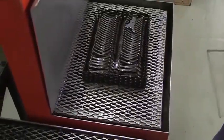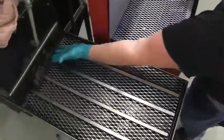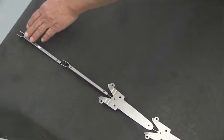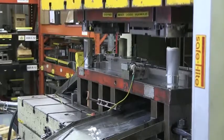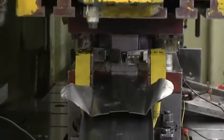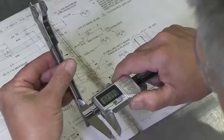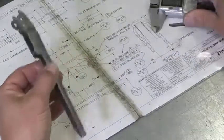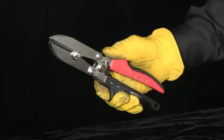After oiling and air drying, the finished blades move on to assembly. A seven-stage progressive die is used to form the Max snip steel handle components. This 160-ton press hits the die with 80 tons of force, and it is only after the seventh hit that the press-formed handle is complete. In addition to first and last articles, a sample handle part is inspected at regular intervals during the run. Gauges and inspection fixtures check the integrity of all handle dimensions, and this data is also used to monitor the condition of the die.